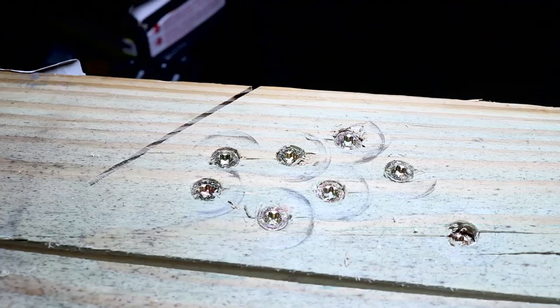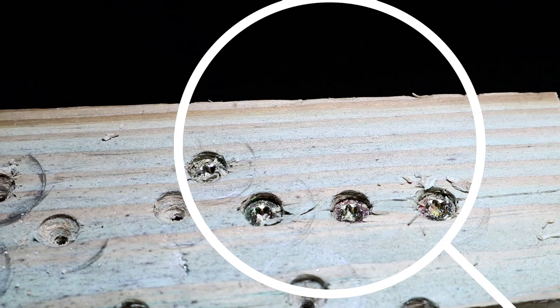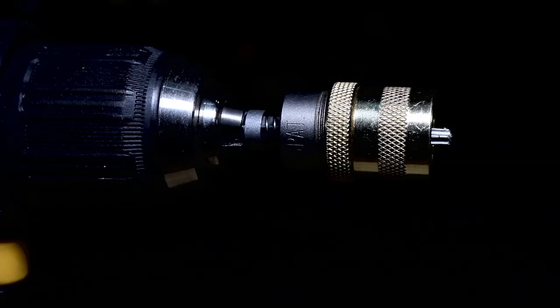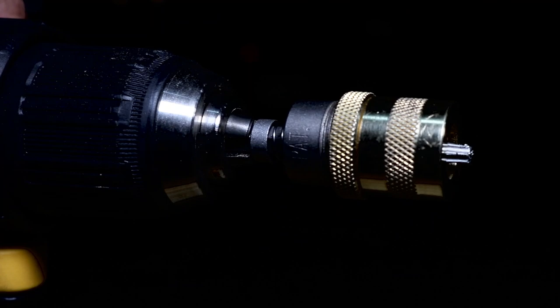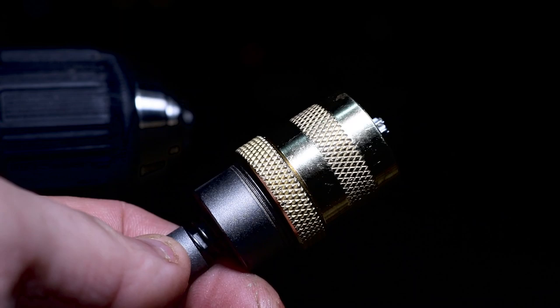There you go — no matter how hard I push on that drill or if I don't let go of that trigger fast enough, I don't have to worry about it going too far down into my material. And if I wanted to go deeper, I could, just like those four screws right there. The price I found for this was only five dollars on Amazon. For what this does, I really do not think you can beat that price. Not only will it work in your cordless drill, it will work in your impact driver as well. The one thing that drives me a little batty is the more you use it, the tighter those collets get. So if you plan on adjusting the depth a lot, you might want to keep a pair of pliers next to you. If not, you can use this continuously.